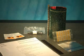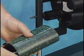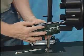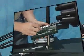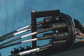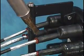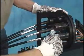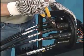To add a cable after the initial installation is complete, a new cable seal kit is required. Additions to unoccupied ports can use either tubular or wraparound seal kits, while wraparound seal kits are required for adding new cables to occupied ports. When adding a cable to an occupied port, the existing seal must be removed. To accomplish this, heat the existing seal. Using care not to cut the port or cable, cut it with a utility knife. Then remove.